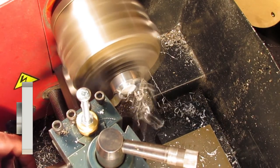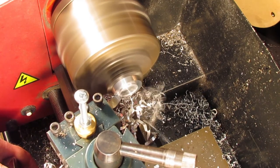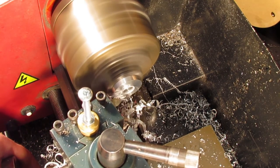Here you will notice a slight transition in the machining. The part went from being held by the outer diameter to the small recess machined. This way I could get the caliper across the thickness of the flange to measure accurately. Light cuts had to be taken as the jaws are only holding on 80 thou material or 2mm of material.